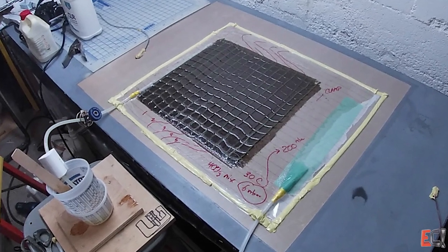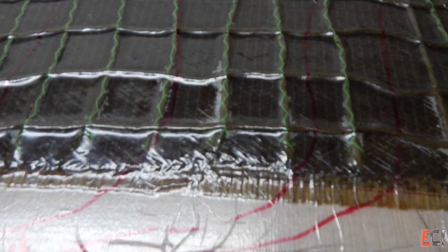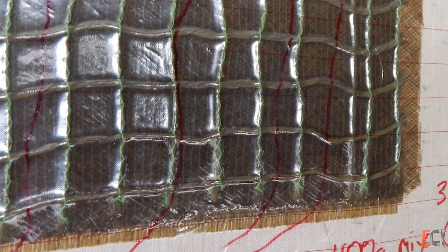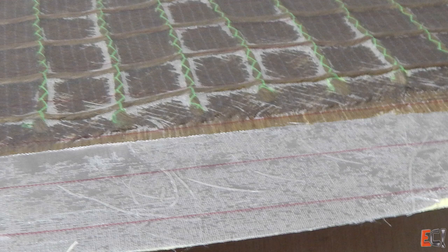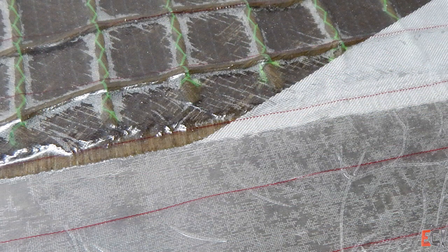It's not making tight corners around that PowerRib, which it'd be nice if that were better. It turned out there was a real problem down on the bottom of the panel — there was some type of small leak and air snuck in and ran up the PowerRib pieces, leaving little voids under the peel ply. And it was definitely a leak from outside the bag — air from outside, localized just to one side.